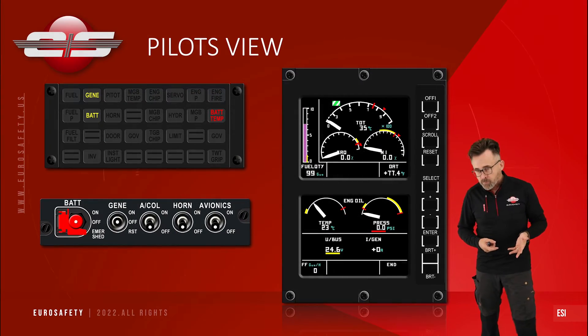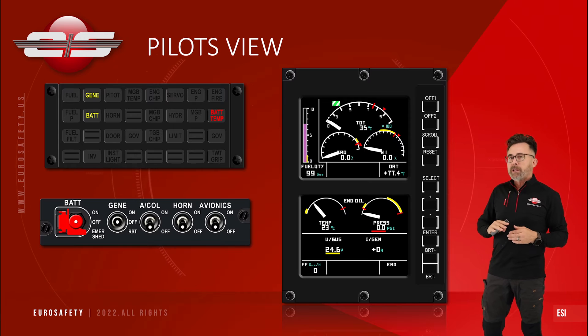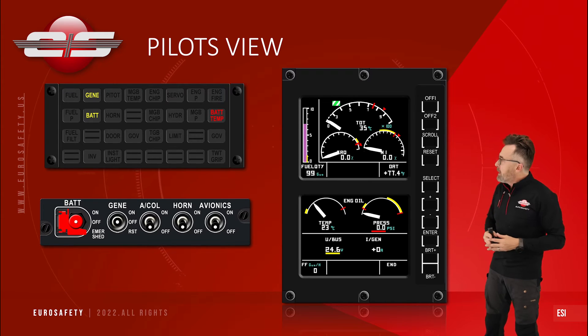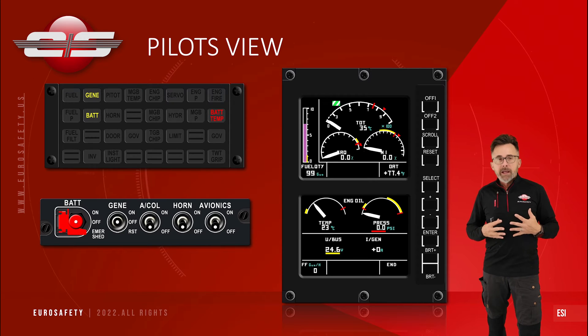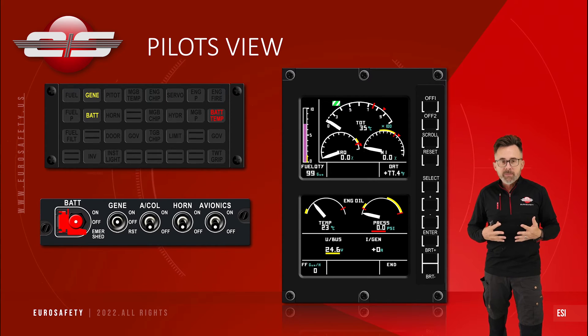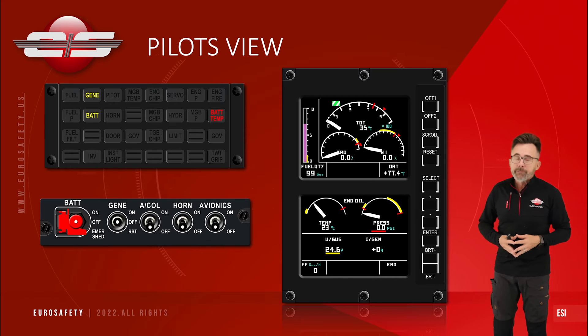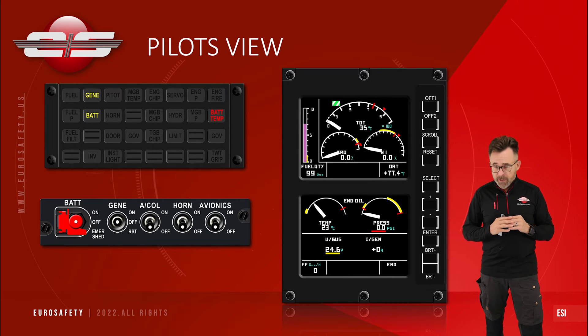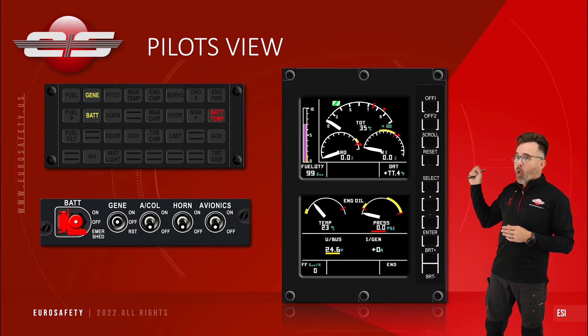When we're looking at the electrical system, there's the pilot's view of the electrical system in the cockpit itself. We have our caution warning panel, and there are three electrical lights that could possibly be on the caution panel. The first one is the generator light. When looking at lights, we need to know specifically what those lights mean. The generator light is not connected to the generator whatsoever — it has no idea what the generator is doing. It is a relay position indicator; it tells you whether the generator relay is open or closed.